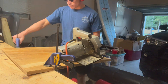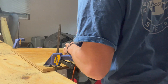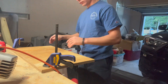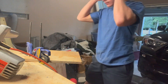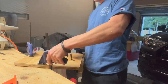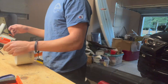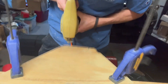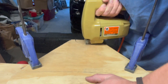So here we're actually building the mount for the telescope. I ended up making it 12 inches wide and 16 inches in height so it floats just above the cabinet. I also made little C-shaped cutouts so the all-purpose drain can fit into it perfectly — I literally just traced the drain and cut it with a jigsaw. For the whole outer shape I cut it with a circle saw. I also made the mount a little more triangular rather than a big giant cube, and I thought the triangle really helped the look.